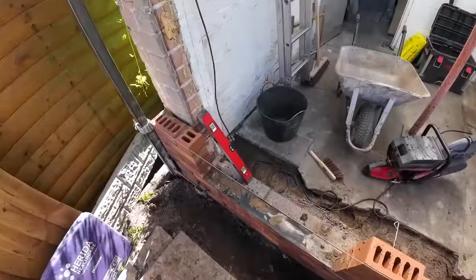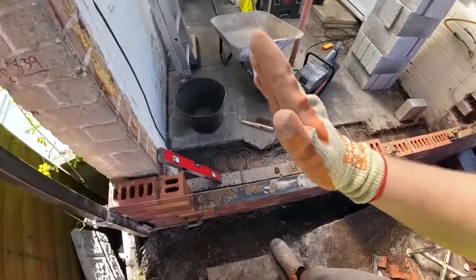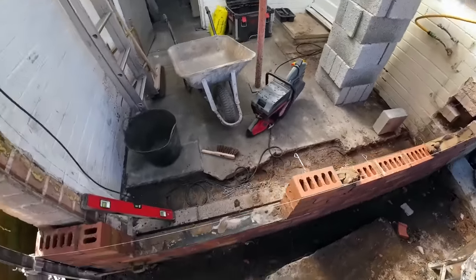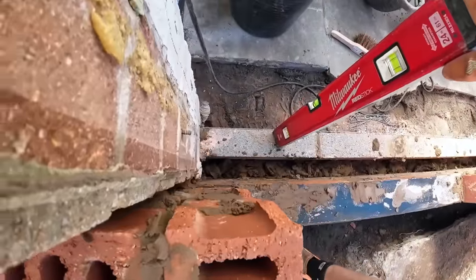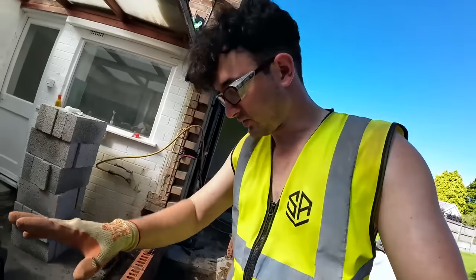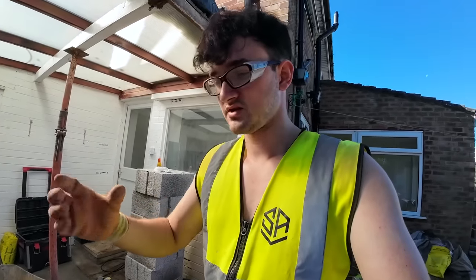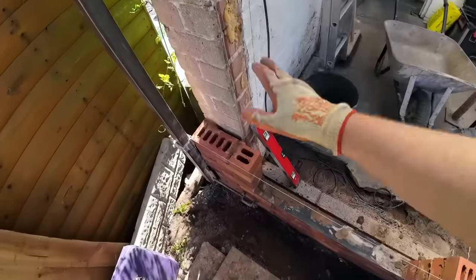Just a side note real quick as well, before I forget. As you can see, we've had to move the doorway over to make room for this window that they want going in. There's not much, it's like a 100mm piece it would be going up there. So what we're going to do is leave the block and get them to stud it instead, because just 100 mil pieces of block all the way up isn't going to be as strong as a continuous stud. So that's why we're leaving tie wires out on that side. We're going to get it studded instead.